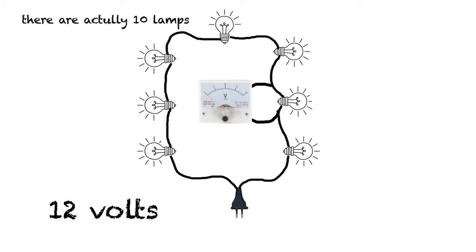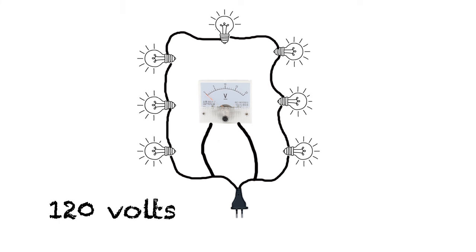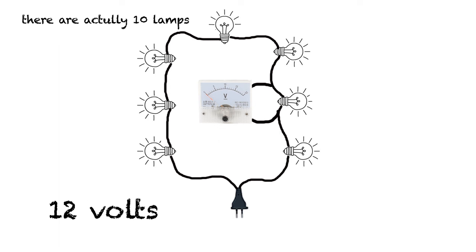When we put a voltmeter across a lamp and it shows we're dropping 12 volts, that lamp is reducing the voltage in the circuit by 12 volts. You can measure anywhere across the circuit to see how much voltage is being dropped at any point in that ring of light bulbs. So why would we ever use any kind of series wiring on our model railroad?